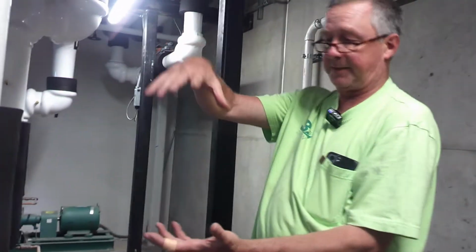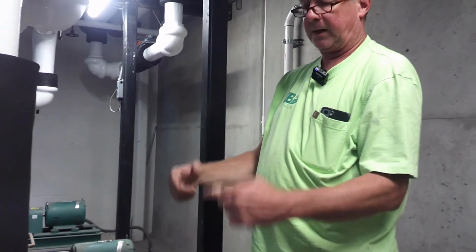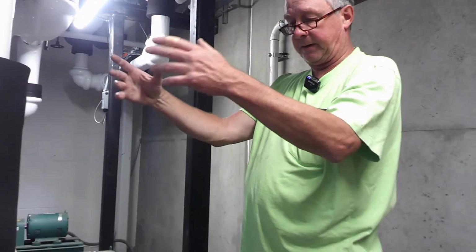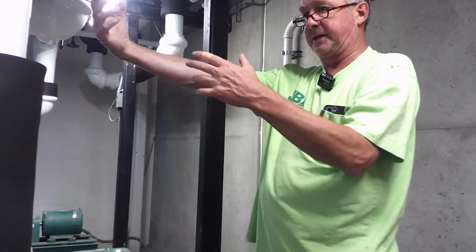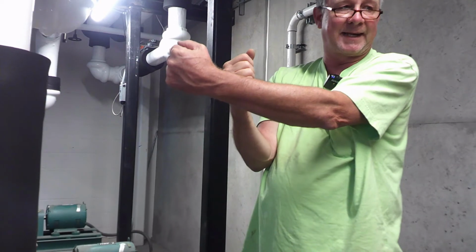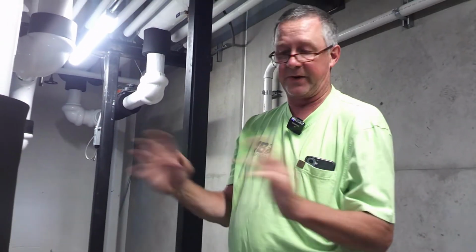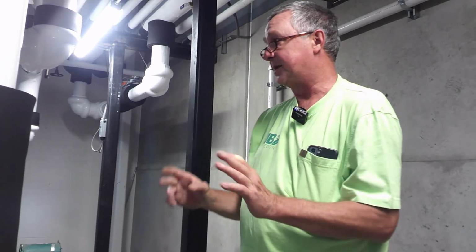Like direct coupled pumps, basically the motor sits up here, the body's here, water goes that way. A lot of times when they put them in up against the wall of piping, they say, I don't want to spin it. Well, when they go to spin it, that gasket's dry, they're shredding that gasket. You really have to turn the motor on, all you have to do is put water to it, and you're done. Water's going everywhere. So that's why I put the grease on.